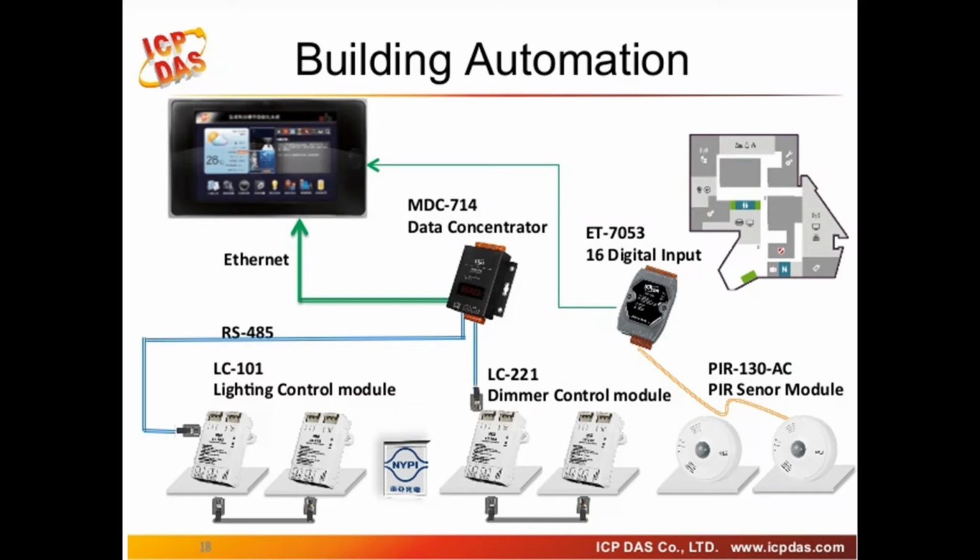On the software side, Modbus is a very standard protocol, and many of the most common building automation software platforms already have Modbus TCP drivers. For those systems that do not, we have many gateways which can be used to adapt Modbus TCP devices to communicate with any protocol.